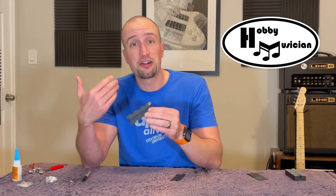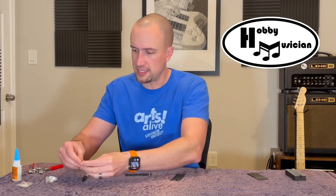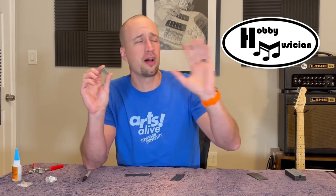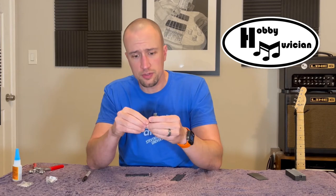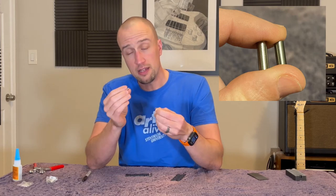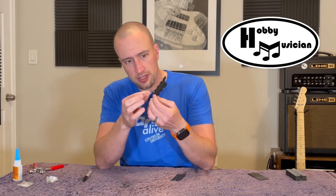By doing that, we now have two anchor points that we can come back and solder our copper wire to — the two wires that need to come out of here. Now, for the rest of the holes, those are going to be for our magnets. Specifically for these pickups I chose alnico 5 magnets, but there are a thousand and one different kinds you could choose. Some pickups use a single rectangular bar magnet, and lots of pickups use these cylindrical rod-shaped magnets, which I chose for a couple of reasons — they're pretty simple to work with.